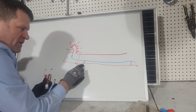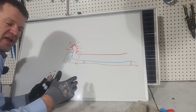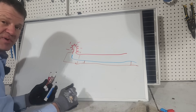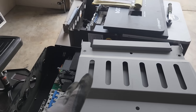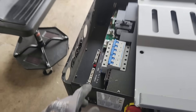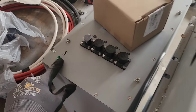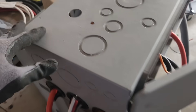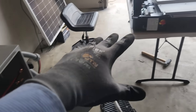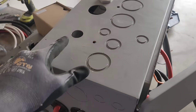All of my solar power equipment will be grounded and connected to this. Suddenly, now I have current going through all of my electrical equipment and through appliances in my house. Here's my current electrical equipment. There's a ground bar that connects to the frame of this system. I've got batteries here, and these batteries have a place where you can connect ground. If I have AC power going through my DC system and all the other equipment, you can see how that can cause some problems.